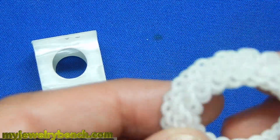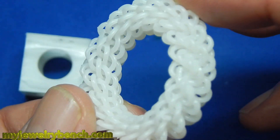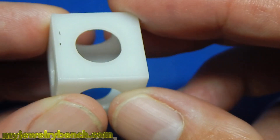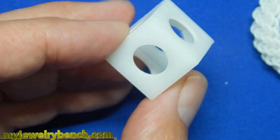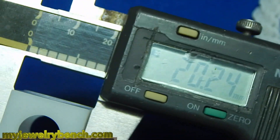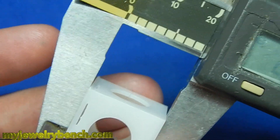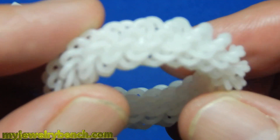After UV curing, this is what I'm left with. I have the knotted torus, which I believe actually printed a whole lot better. I think curved surfaces with this resin print phenomenally, and this printer prints them great — that's why I like this printer for jewelry prints. You can see the detail there, and I'll put up some photos for a better look. On my block after curing I still have the lines; there's nothing you can do about that, though I could probably finish it with some sandpaper. Measuring the cube: we've got about 20 millimeters — it did shrink about 0.01 millimeters on each side, which is really insignificant. I think this is a result of this resin — flat surfaces print really bad on it — but the knotted torus came out really good and I'm very happy with it.